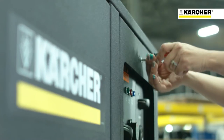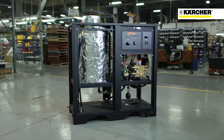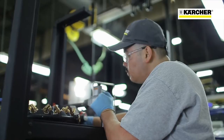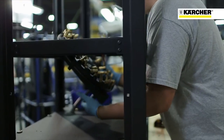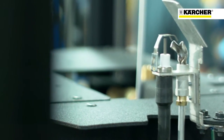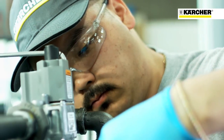The machine is made with removable panels, so it makes access to the components very simple from 360 degrees around the machine. One of the items inside that burner housing is our drop-out coil assembly, so it makes service easy getting to our jets for any type of maintenance or service. We have a stand-alone pilot light — it stays stationary while the drop-out burner drops out and is hinged for easy access and servicing.